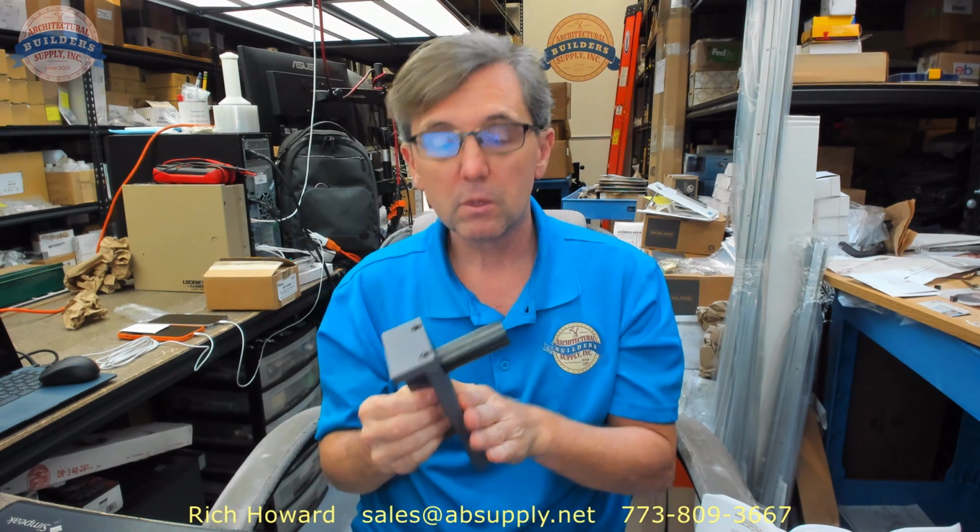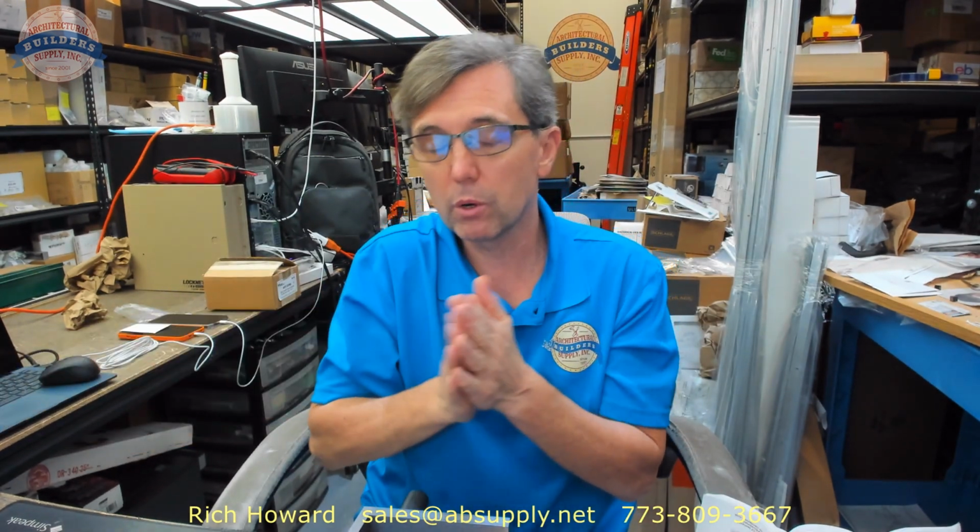However, people do it. Now, you shouldn't necessarily be having to drill a lever extension flush bolt in a wood door. You should use a wood door style, which is like a corner style flush bolt. You don't have to drill any long, dangerous holes where you can breach out of the top or breach through the face of the door. And if it's a fire-rated door, you wouldn't be doing that work at all anyway.